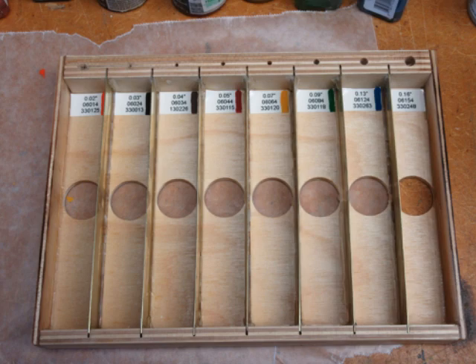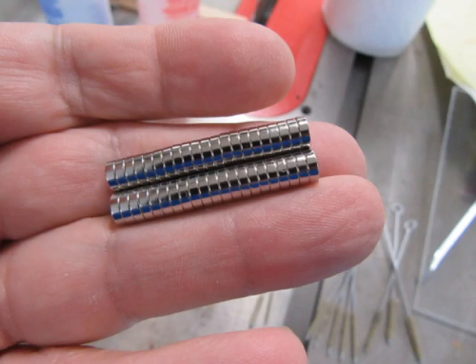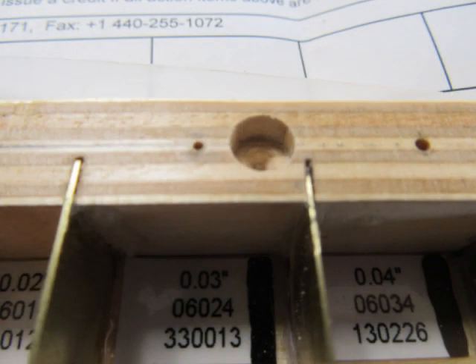I decided to attach the cover with magnets. I went on Amazon and bought six by two millimeter neodymium magnets, a box of fifty, for just about five dollars. They're nickel plated as these usually are. Being six millimeters, they're pretty close to a quarter of an inch, so I was able to use a quarter inch Forstner bit to cut shallow recesses into the wood in four places — just a hair shallower than two magnets stacked, so the top one sticks out just a little bit above the wood. I put two on the rear half inch piece of plywood and two on the quarter inch front piece.